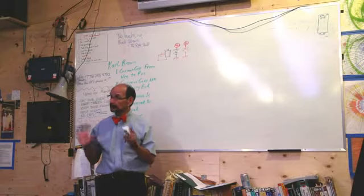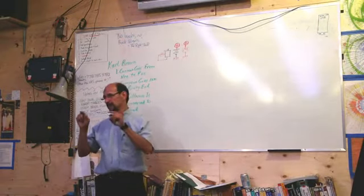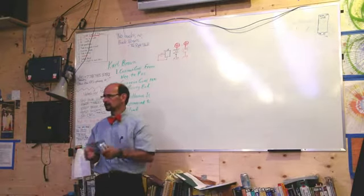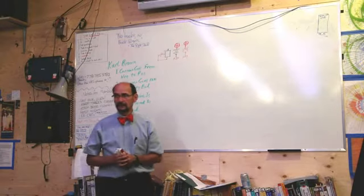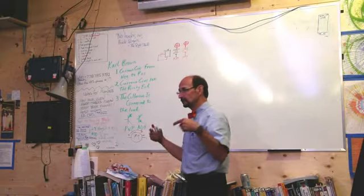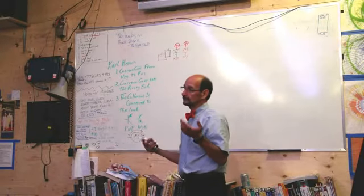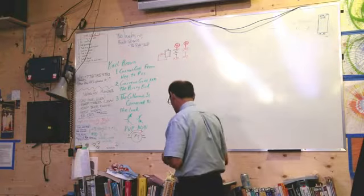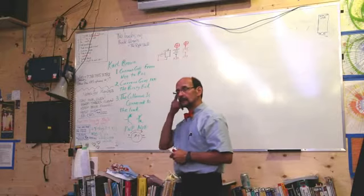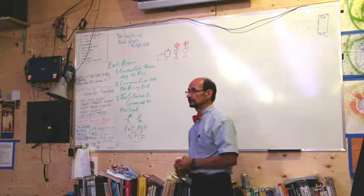They are completely different in the sense that you don't just apply power to them — you have to apply power to this magnet but not that one, and you have to know when it's all happening. It's microprocessor-complex. DC motors are very nice, very simple, and they're very crappy because they've got brushes that wear out. But if you've got a decent motor, you can buy new brushes for it. Most cordless drills and windshield wiper motors are DC motors.